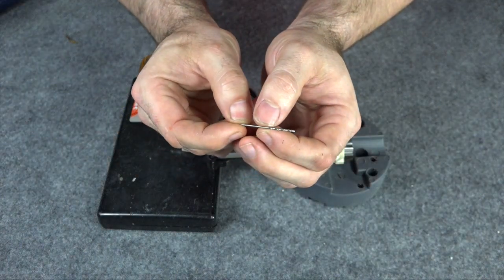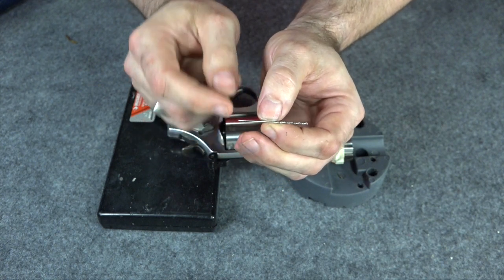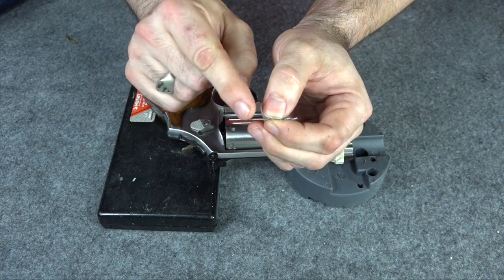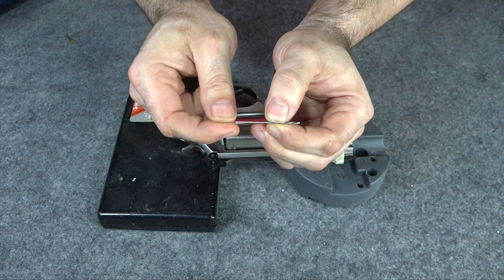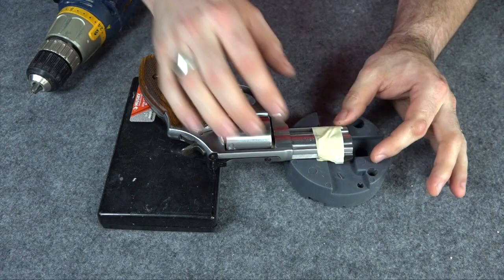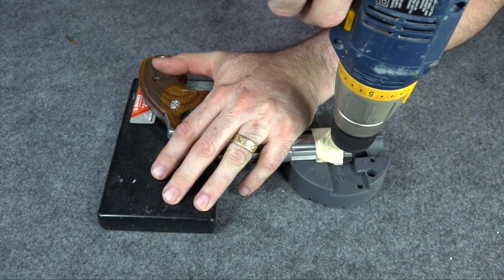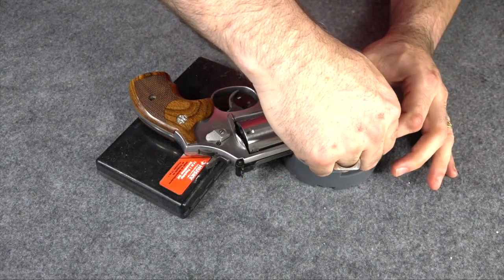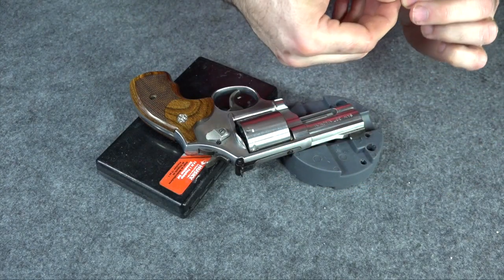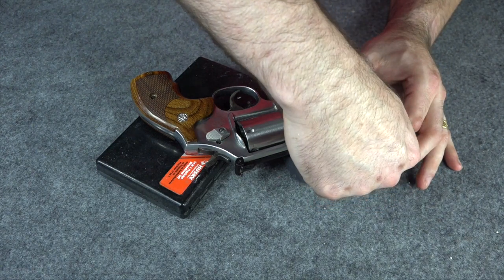Here I've got my number 54 drill bit. As you can see, it's pretty thin, so it's pretty fragile. Make sure you drill straight up and down when using one of these. And once you break one — which you will eventually if you change a lot of sights — keep the little back piece of it, because they make for a good little punch when taking out these size pins later. Once I have the sight in place, I like to tape it so I've got less of a chance of it moving around while I'm drilling. Now that it's drilled, I just have to put the pin back in. It might seem intimidating to some people to drill out a front sight, but as long as you take your time and do it slow and right, it's not hard at all.